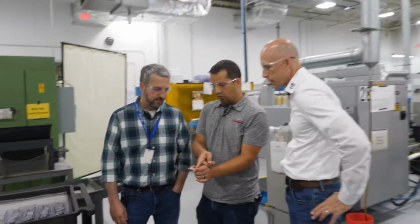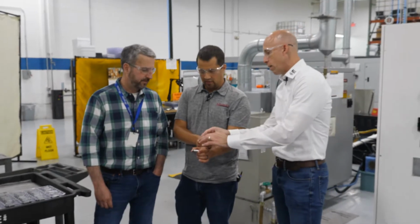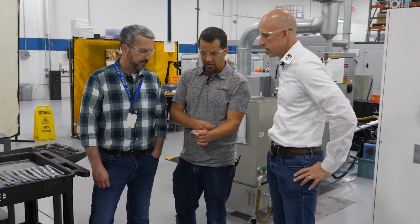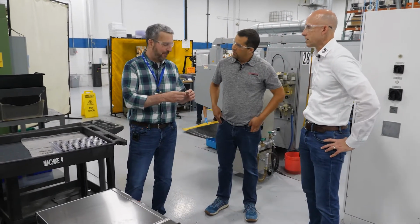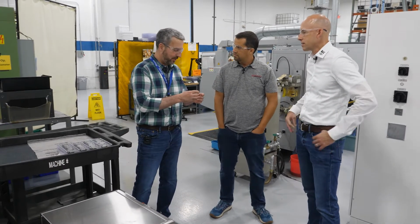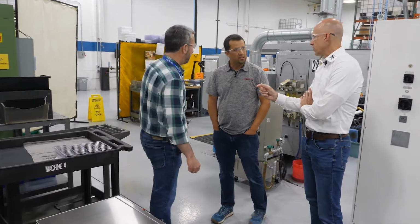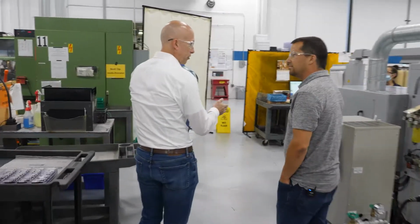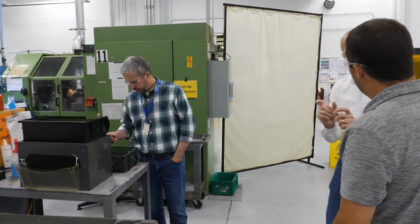So what's all the grooving on here then? So that communicates oil in the part. It's lubrication. Yeah, exactly. Plus, there's a movement requirement as well. If that was all one solid piece, you could create some other hydraulic issues. That part's constantly moving because it's balancing, because you can have different load pressures versus pump pressure, but you want to have the same speed, and so that's what that does. That just keeps that speed going constant.